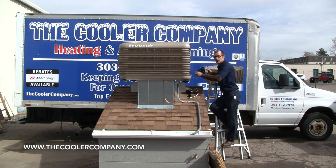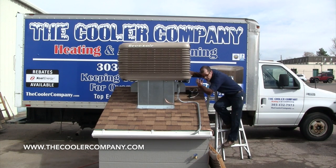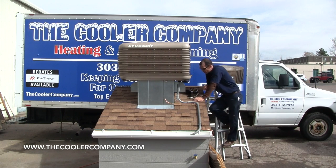Since I'm already up here, I'm going to start with the drain valve. If you can see, it is keyed — it's most of a circle and there is a slot cut in one side, to ensure that you can only put it in the correct way. There is an O-ring that sits around here and creates the watertight seal. Make sure that that is in place. Press it into the cooler, and with the lock nut, you just spin this on. Hand-tight is typically fine; if you have some pliers and want to give it just a little snug, that's perfect as well.